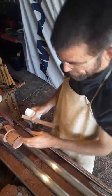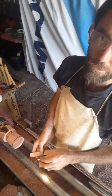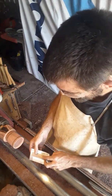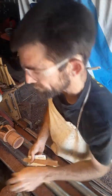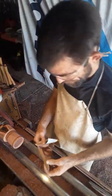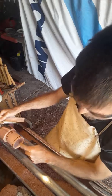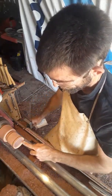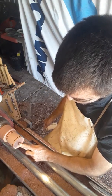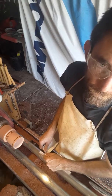When it comes to the inside here, your fingers are always the best thing because you can actually feel what you're doing, but you get quite hot in there and it burns your fingers. So I use balsa wood — and there's another stuff I've got here, the name escapes me, I think it's camphor. You can actually use them for polishing. The balsa wood is quite good — you can use it straight on there and it'll actually start polishing it up. I can see it shining now already.